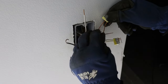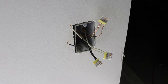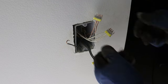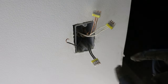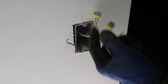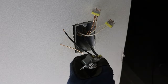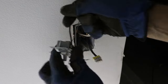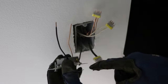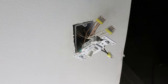The grounds just need to be connected because they connect back to the panel box in case anything gets energized. All the neutrals are doing is carrying all of the current back to the panel box to complete the loop. Here is the hot that comes in — we need to put a switch here so when the switch is flipped, now we've got electricity going up to the light. I've already gone ahead and connected both of the pigtails for the ground screw and for the hot wire. We'll just plug those in and that's it.